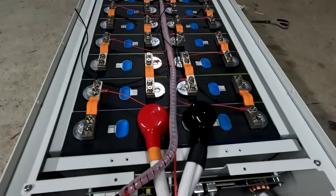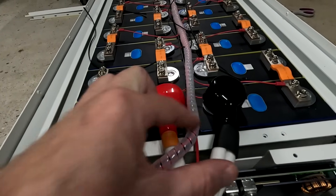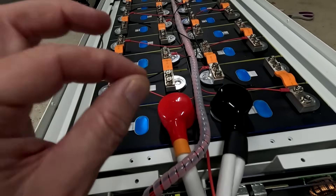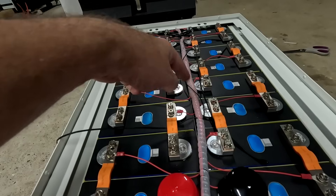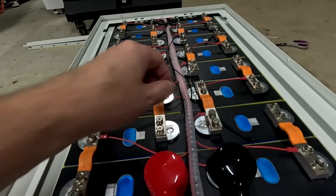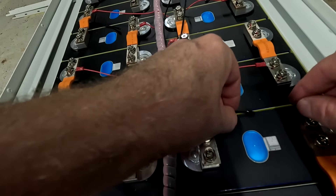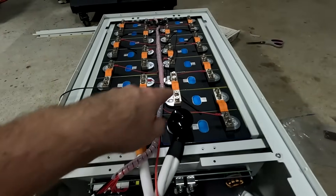I think I made a bit of a mistake here. I've used this spiral wrap, but I haven't got the right size — it's actually a bit small for all these cables inside. I started with the split loom, but that was not the correct size either. I need to get a 13 millimeter split loom and this will work perfectly. I've extracted all the temperature sensors, but they are far too long, so they need to go into the spiral wrap as well — I'll keep the sensor here and pull the cable in the spiral wrap all the way up and glue it on top of the battery. But I've now forgotten to integrate this cable and there's no way to put it in anymore. I usually don't use spiral wrap here at all — I don't like it, it's just such a final solution. I could have used Velcro. In the next box we'll use Velcro. But for now, all the cables are organized and I'll take care of the temperature sensors later.